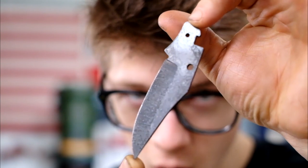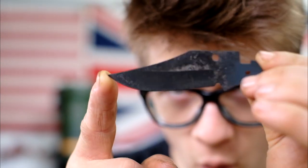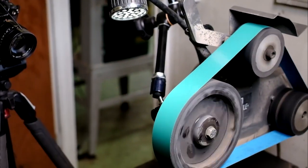We have done the bevels, normalized it three times, hardened it, tempered it. Now we need to do the rest of the finishing. Then we're gonna work on our final fit up. Cool. It's exciting. Pressure's on. We can't mess up at this point. No, we literally cannot.